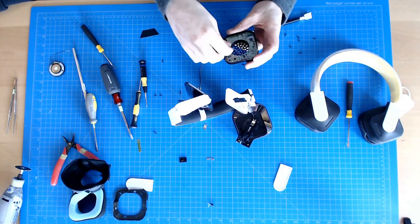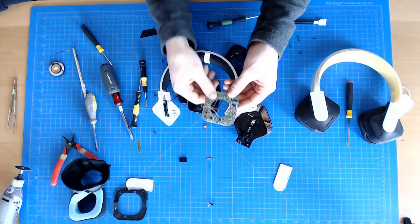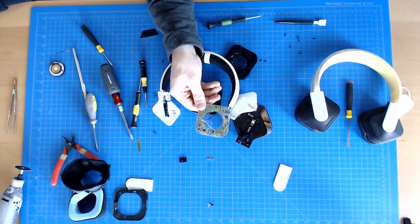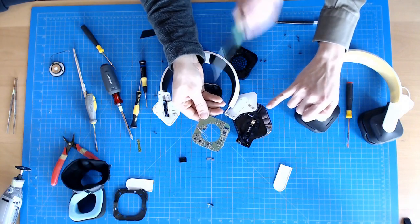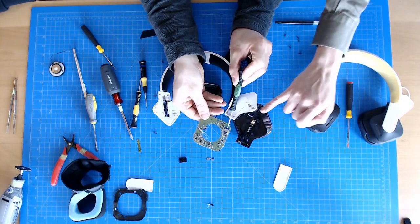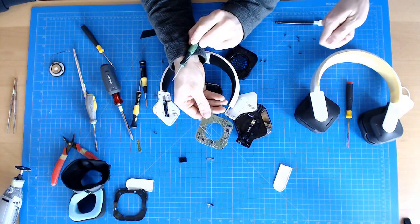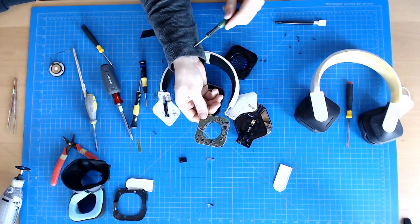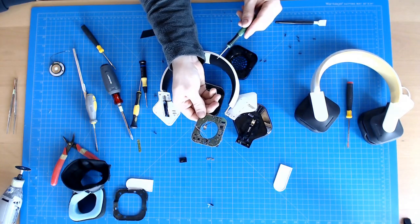That's really awesome. So maybe we don't have to get into depth, but for all of our double E's out there, can you tell me some of what's going on the board here? Yeah, the board side, not as much other than there is a Bluetooth module. That's this guy. The signal processor is also here. Okay. And because this is a wired headphone, it's still analog signals into and out of the audio jack, as you pointed out. And so why do you need the Bluetooth if there's an audio jack?